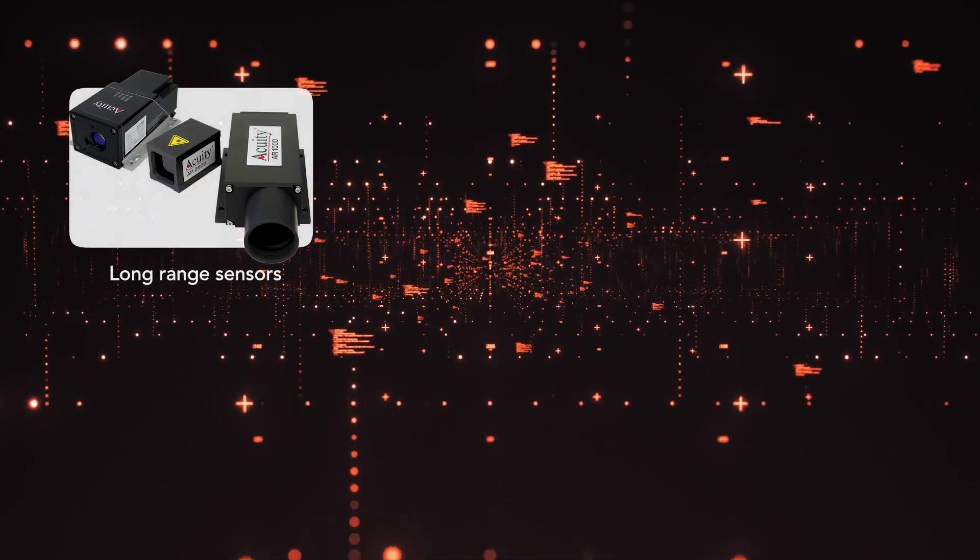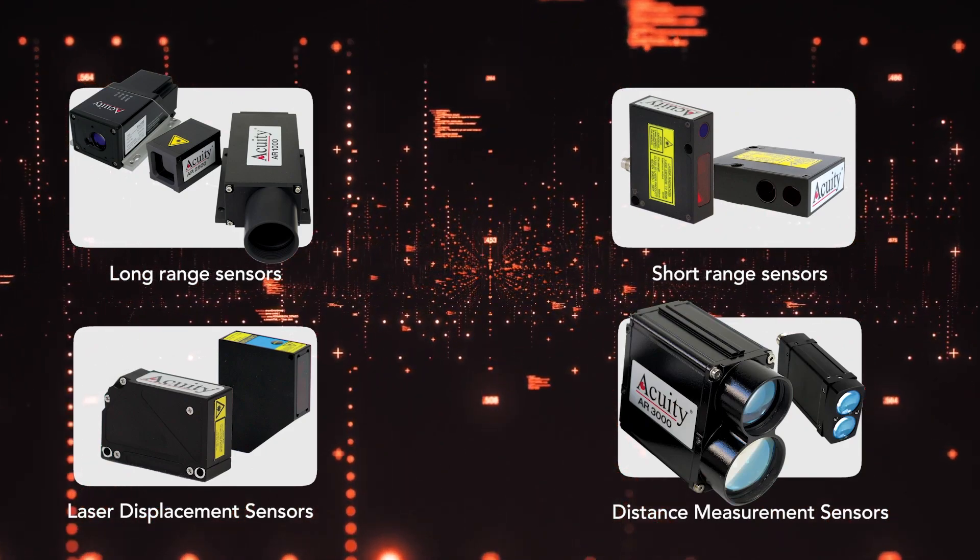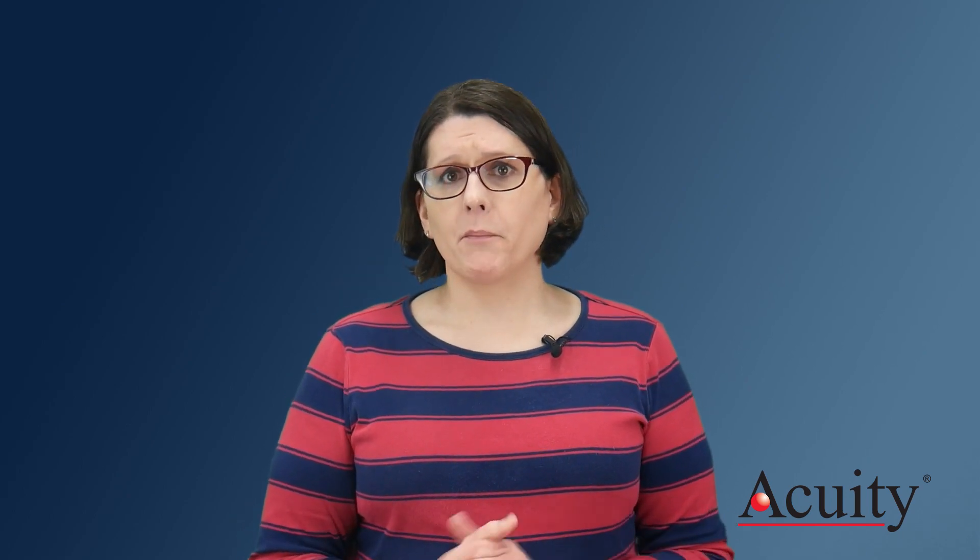Even so, we can't test every potential target. If your target is darker or shinier than a sheet of paper, you may not get as good of a reading. That's why our pool of demo units are so important — you often don't know exactly how accurate a sensor will be in your application until you try it out. So linearity isn't the accuracy full stop; it's a measurement of the accuracy in certain conditions that allows you to compare sensors from the same company, and for the most part, sensors from other companies as well.